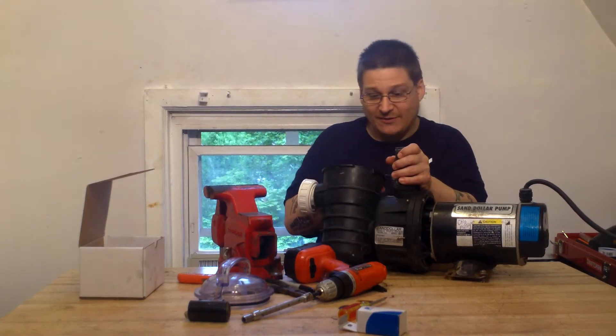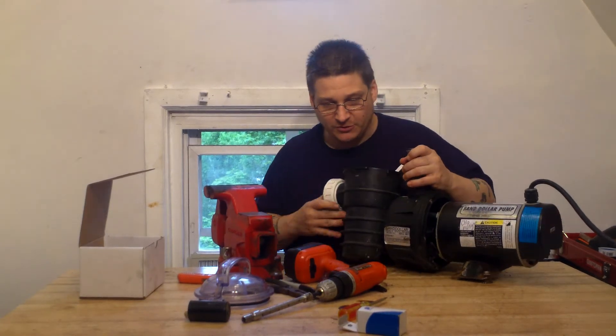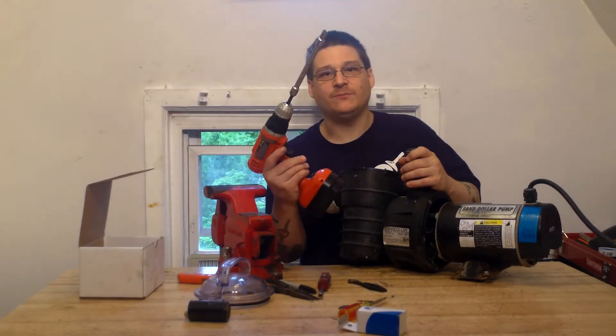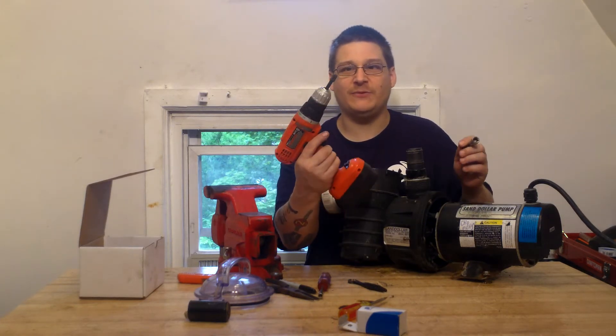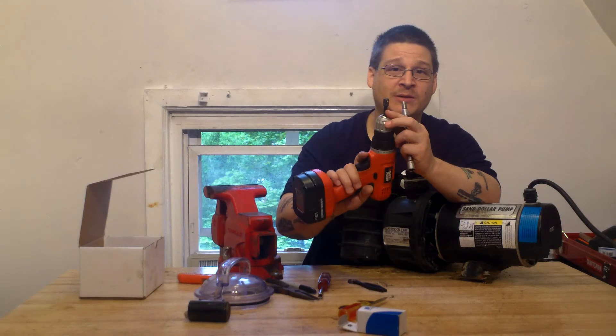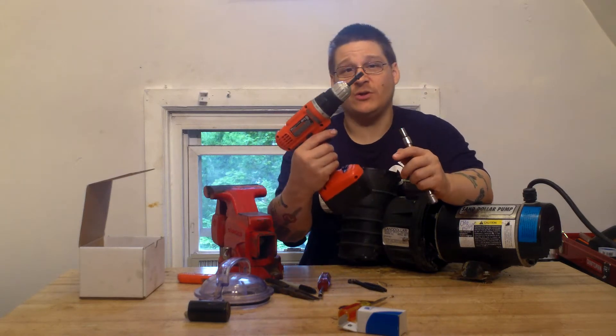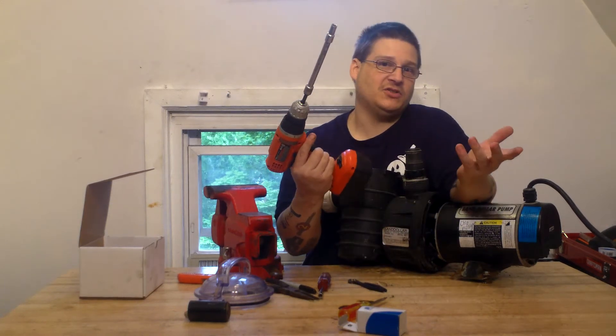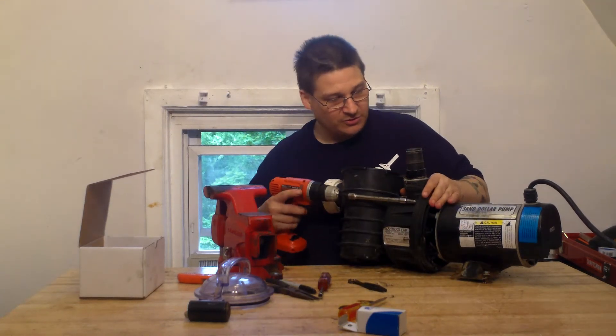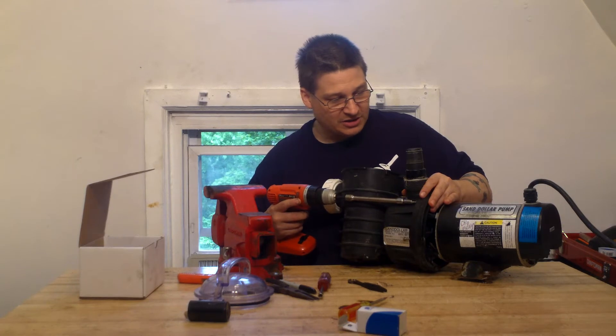This pump housing moves back and forth just like this by turning it, so you can access all the bolts. I'm going to use a screw gun with a socket adapter. If you've never seen that before, it's pretty handy — you can get it at Home Depot or Lowe's. Robert had never seen it before and he worked here. You can buy it for about $3, connect it right to your sockets, and you get yourself an impact driver.